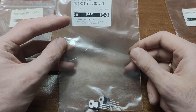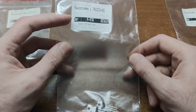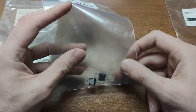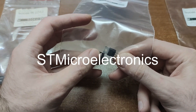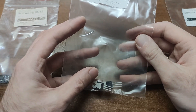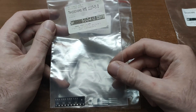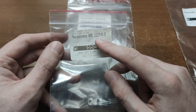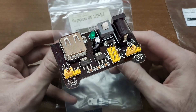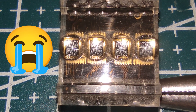Let's speak a bit about voltage regulators. Grab the 7805 and 7812, but exactly in this package and from a well-known brand such as STM. They've got built-in protections against short circuits, overcurrent and overheating – unlike, for example, AMS1117 regulators on some cheap breadboard supplies. Those things can fry themselves and your project. I've done that, and then cried over that unique retro display.